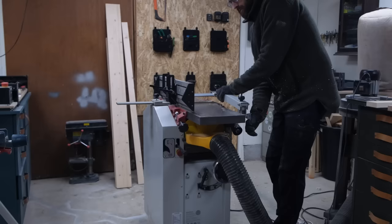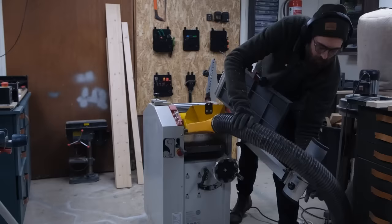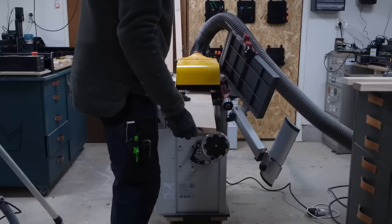I have one of those combined planer thicknessers, and it usually takes some time, but I think this machine has been serving me really good. It's the Craft machine from Axminster. Oh, and this is not sponsored. The only thing is that it takes a bit of time switching between the two. And you have to crank the wheel to lift the table up for the thicknesser because it's in the way of the big yellow dust extraction port.